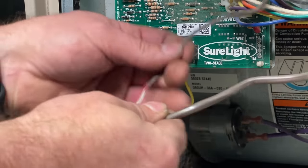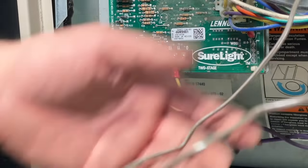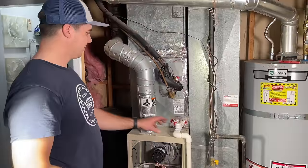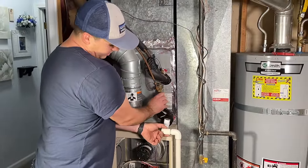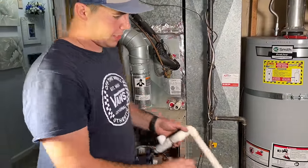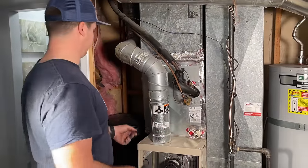Once we connect these, we're going to clean them all up and make them look nice — they're pretty straightforward. We'll also show you how to wire it up on the new furnace. Let's go ahead and pull these out of the case. Next we're going to work on our condensate drain — all of this is going to be replaced, so we're just going to cut it with pipe cutters, make sure it's drained out, and we'll disconnect our venting.